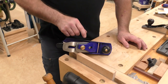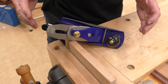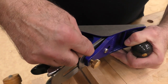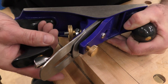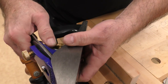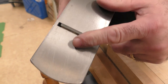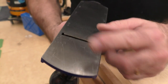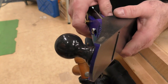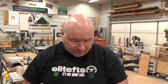You can also see here where the cap iron is bowed. Someone goes and buys one of these — I have this fully adjusted forward and I can't retract it any more than that. If I move this fine adjuster back, it's just going to keep going forward. So this is the best adjustment I have out of that clamshell.